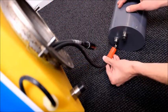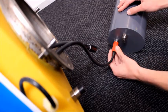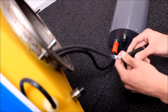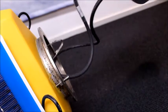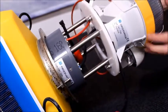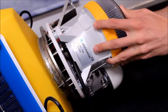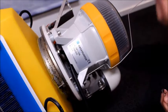The sensor cable and the power cable can now be connected to the electronics canister. Again, make sure that the connectors have been greased properly. When fitting the power cable, note that the other end of the cable is not yet connected to the battery canister. The electronics canister can now be slid into the hull. Note that the cable strain relief is not used here — it may be used later to pull the sensor out of the deployment tube. Fit the two retaining clips to lock the canister.